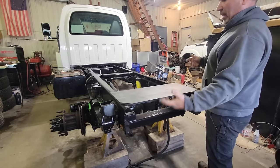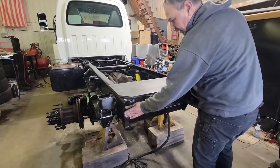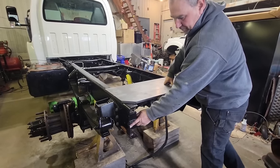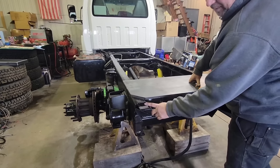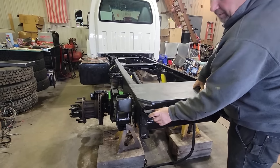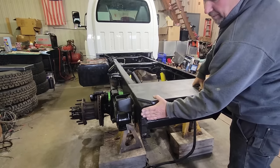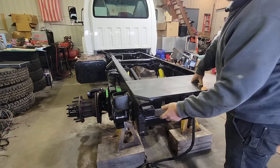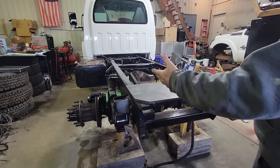Then there's the other way, which is the way I prefer. I prefer to cut the plate so it slides inside the frame rail. I don't need it to go in very far, just far enough that I can lay a weld here and then have the plate and lay a weld on the inside. I like the fact that it spreads that weld, staggers it instead of having the plate, the frame ground, and a weld here and here. Do I like it? Yeah, most definitely.